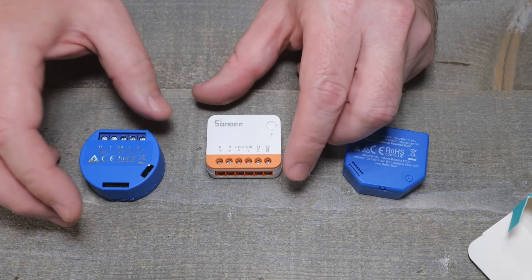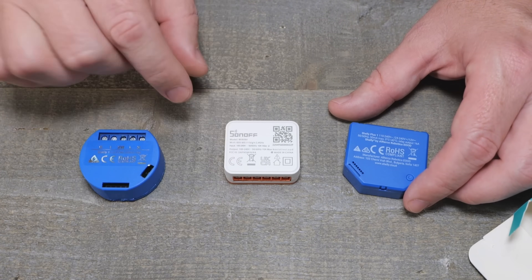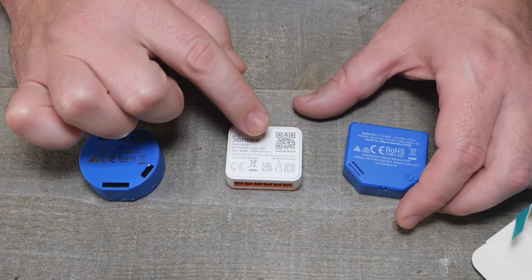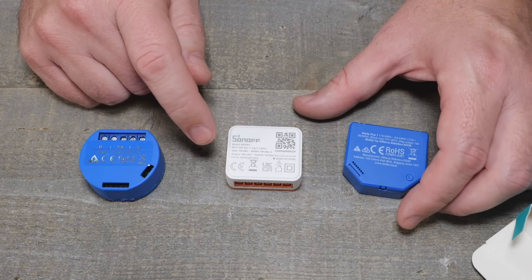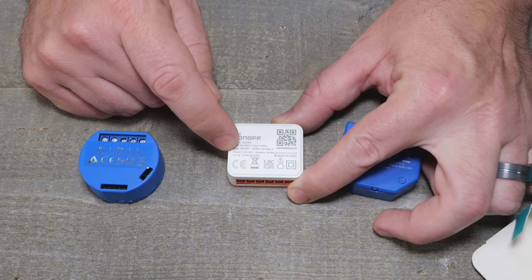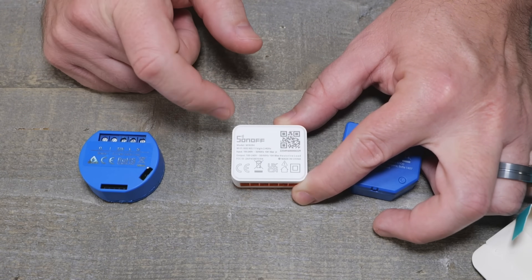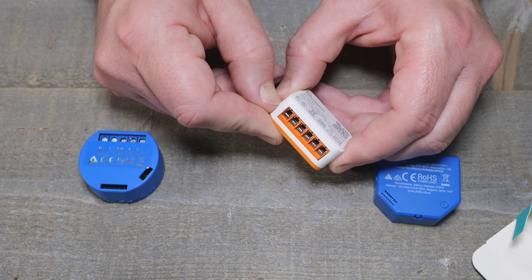One thing I'll talk about that some may not understand depending on the country: I don't recommend running this unless it has a fuse inside. In the US, most home circuits are 15 amps, and if you put a 10-amp device in line with a 15-amp breaker, the breaker is always supposed to be the weakest link. If you have a short, the breaker pops and you don't have a fire. But if you put a 10-amp rated device in there, you've made a weak link there — potentially it could overheat and catch fire inside your box. So hopefully they have a 10-amp fuse inside.